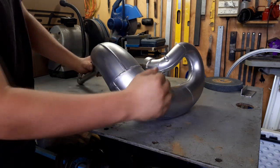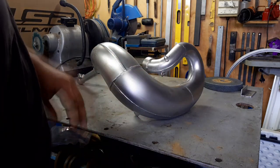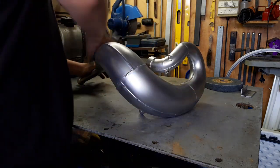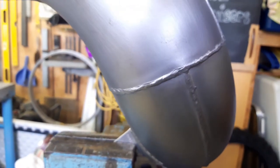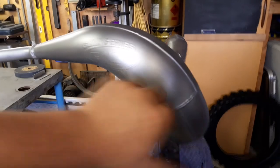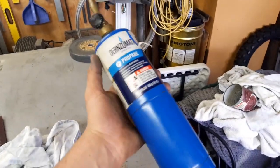I'm just going to go one way with the scotch brite because it leaves very fine scratches, so if you just go one way then it actually gives it a sort of brush finish and doesn't leave it all cross-hatched. I've just given it a once over with the scotch brite — as you can see it leaves very fine scratches. I'm actually quite a big fan of the brush look, so I've just gone one way the whole way around the pipe, and that'll give it a nice even finish. I've cleaned up all the rust on it, now I've got a propane torch.